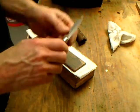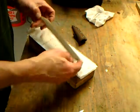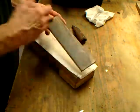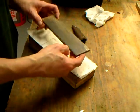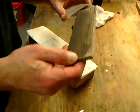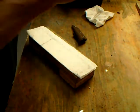There is just the tiniest feathery burr on the end of there. If I had used this a couple times, I'd wipe it off — because it's black compound, I can't really tell how dirty it's getting with metal swarf. Obviously at some point it will have such a high percentage of swarf that it will start to take the grinding down a little bit. Rather than wipe everything off, I'll just throw it in a bag. If it gives me any trouble next time I go to use it, I'll wipe it off and start over again.